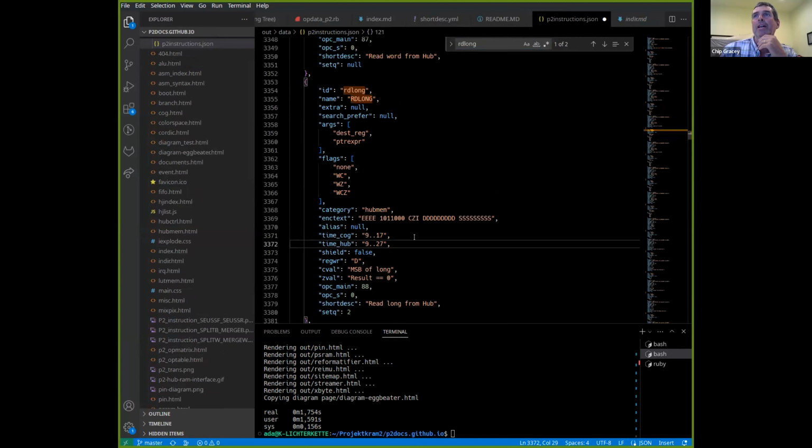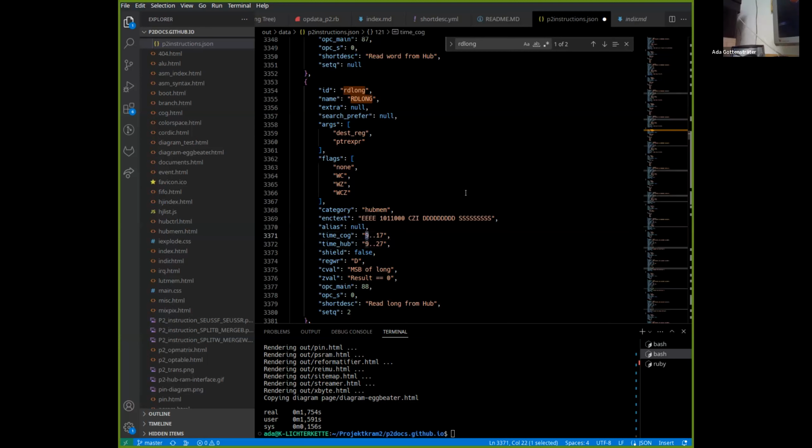I just ran a bunch of tests where I would introduce all kinds of random delays. I mean, then it takes longer. I don't think it actually hits that 27 very often. Yeah, it was a really extreme case. It might have. But I was really concerned with the baseline of the 9, because even if you copy a line, it still takes 9 cycles, which is kind of a lot. You could do 4.5 other instructions in that space, where you can read like one shitty byte of the memory.